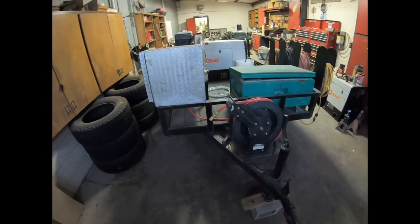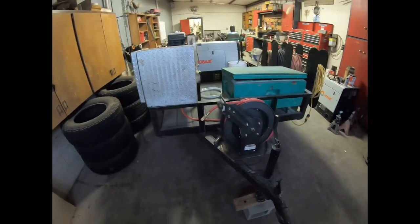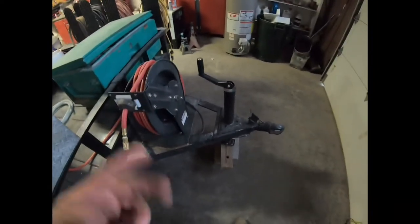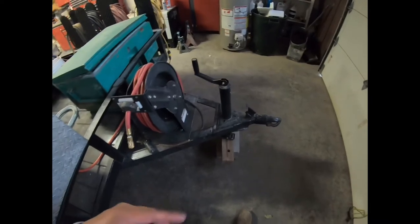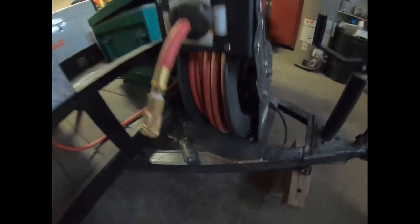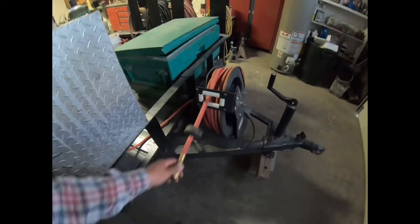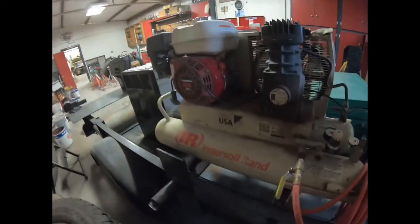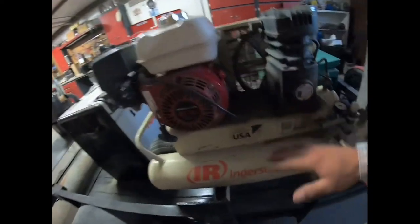The flooring on it is six-inch purlin all the way through. Up front we went ahead and replaced the jack — there's a small Bulldog jack on it. Up here we welded a plate and this air hose reel worked out pretty good. That air hose reel is connected to this Ingersoll air compressor. I put it up in the air with just some angle iron so it could be flush with the outside and easier to service — you're not having to fight the rail.